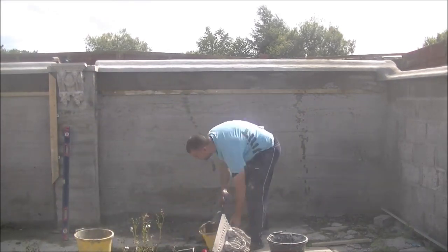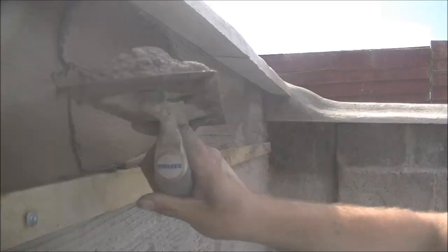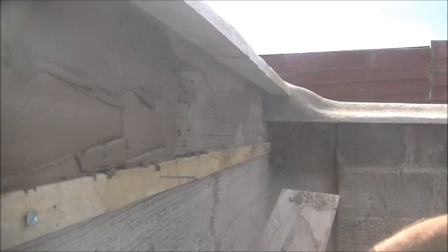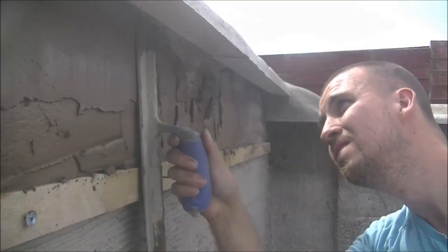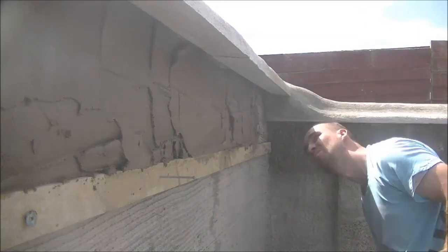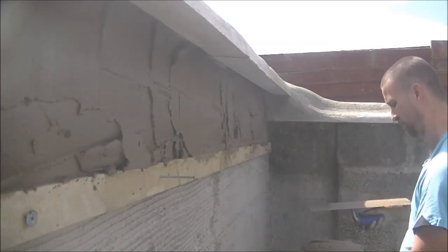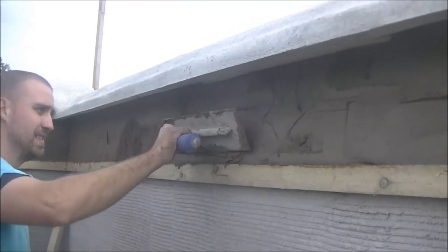You might also want to mix this up a bit stiffer. I'm working in such an awkward wee area — you should know there's a wee lip underneath, a bit of a drip, just have the water running right round. I'm trying to work up right onto that, so I hope you appreciate the awkwardness of my work here. Getting on well here. Almost got the first butter coat done of my brown render for detail, and now on to the second coat. It starts really taking shape when you're getting your second coat on.